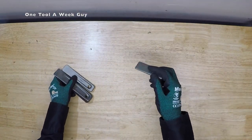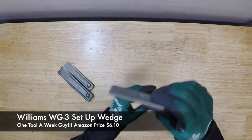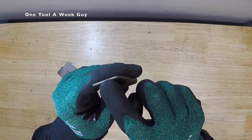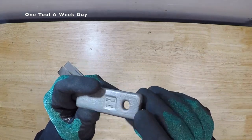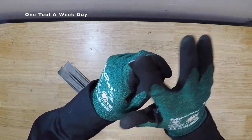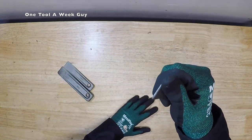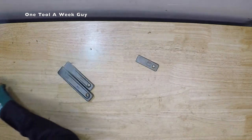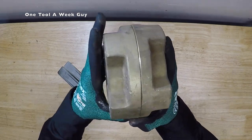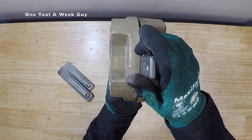The first one is going to be the Williams WG-3. This is a three-inch long wedge, one inch wide, a sixteenth of an inch thick at the front, and up to a quarter-inch thick in the back. I like to sharpen these on the side — get my grinder and give it a little sharpness. The main purpose is when you have flanges that are too close to each other, you can space out your wedge, hammer it in there, and give it just enough space.